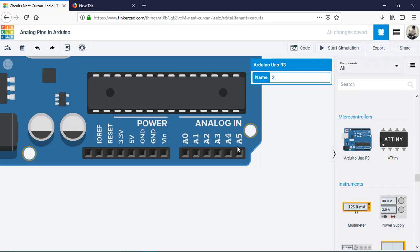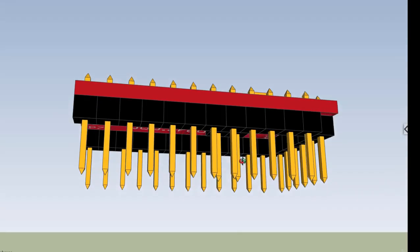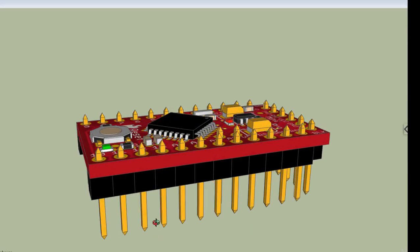We have to consider that turning on a pull-up will affect the value read by analogRead. So if you have just assigned a pull-up resistor on a particular analog pin, maybe A0 to A5, then it will affect the input coming from outside, which is in analog format. Why will it affect? You can understand it: you are just pulling up the line voltage. Initially you are pulling up a line voltage and you are providing an external data, so probably it will affect, right? Yes, it will affect.